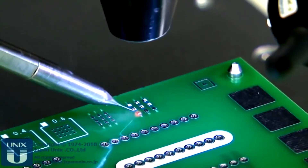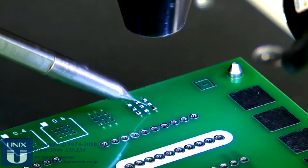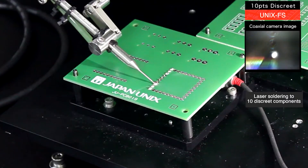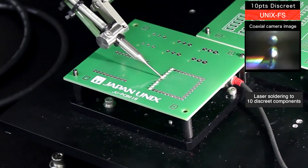One of the advantages of laser soldering is that the laser technologies have the ability to reach areas which typical tip soldering is unable to achieve. There is also the ability to be very precise with where you place the laser spot, which means you are able to avoid burning parts or metals that are close to the area where you actually want to solder.